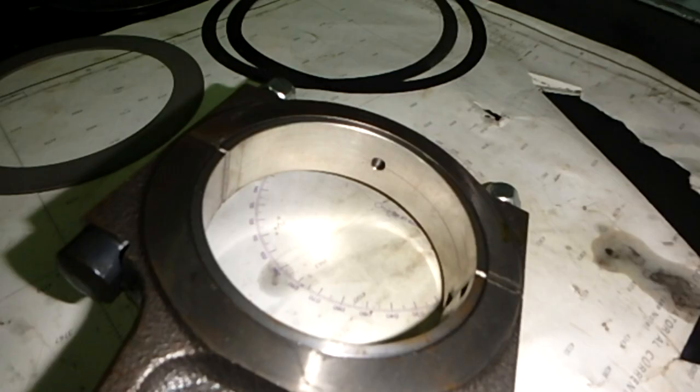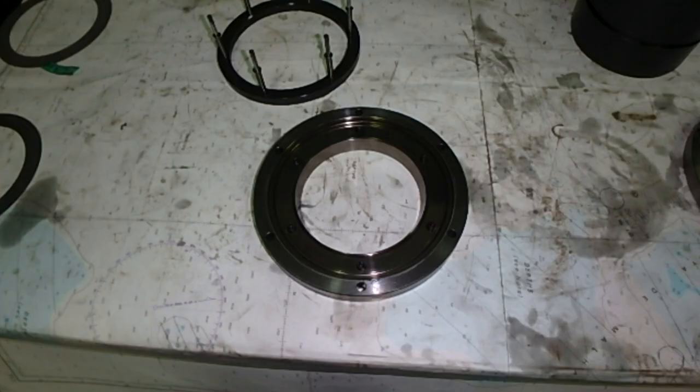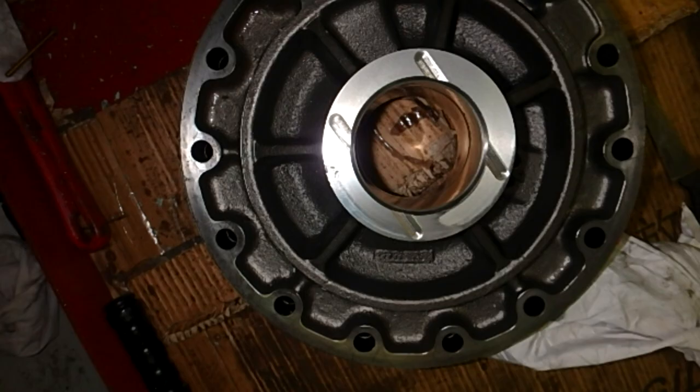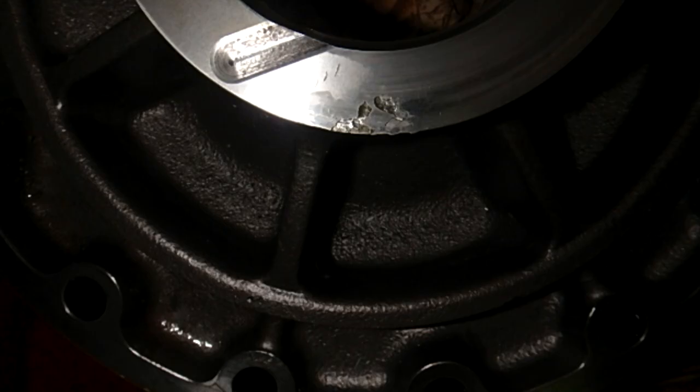And also a very good practice is, before filling the oil and before opening all the valves to connect the system, to make a vacuum and leave your plant, your compressor, under vacuum to see if the vacuum drops, to determine any leakages from your packing, from your gland seal.